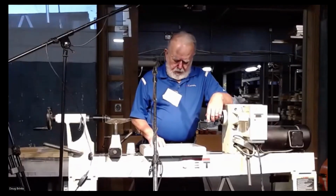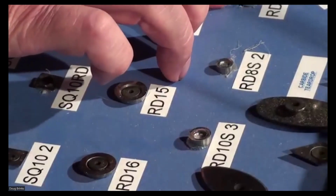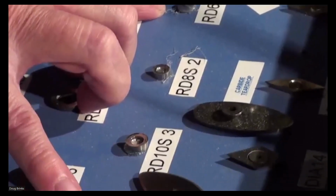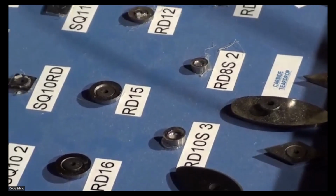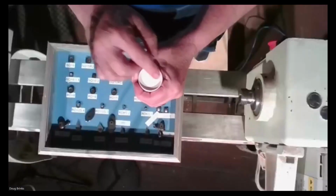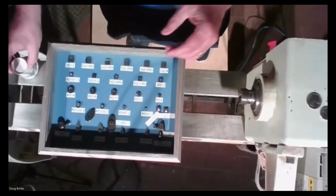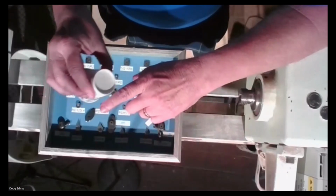Now, the other is the shear cup cutters. These little jobs here range from 6 millimeter to 12 millimeter. They are the most aggressive cutters in the market today. So if you can imagine, if I blew that up and looked at it, there'd be a screw in here, and this is my cutting edge. And if you go straight in, it's aggressive. I mean, it's just gonna tear you apart. So you always do what you can to tip these at an angle and slice the wood.